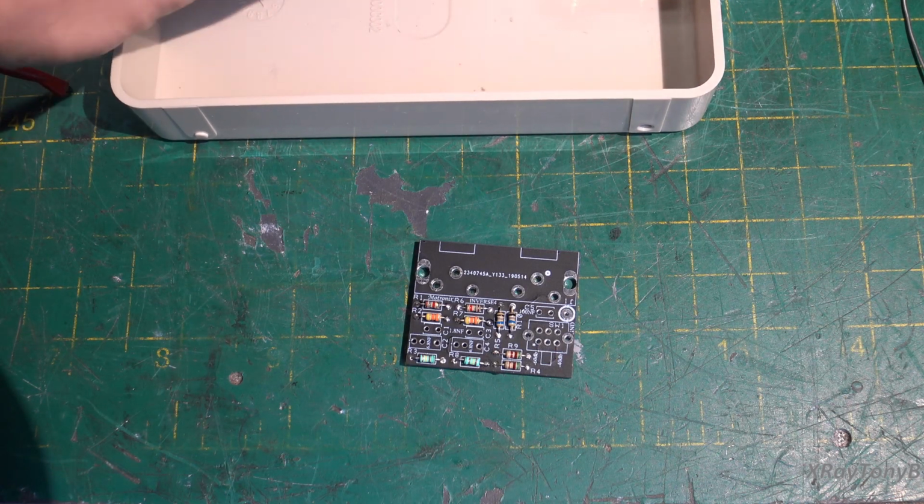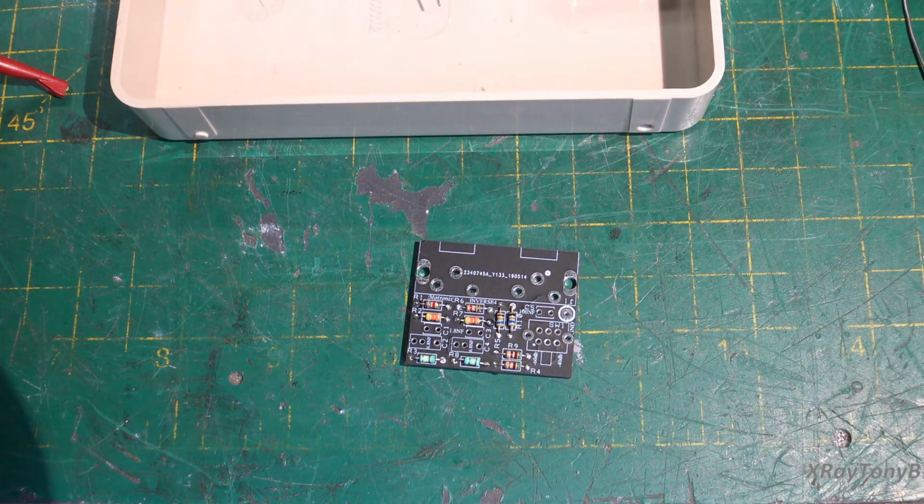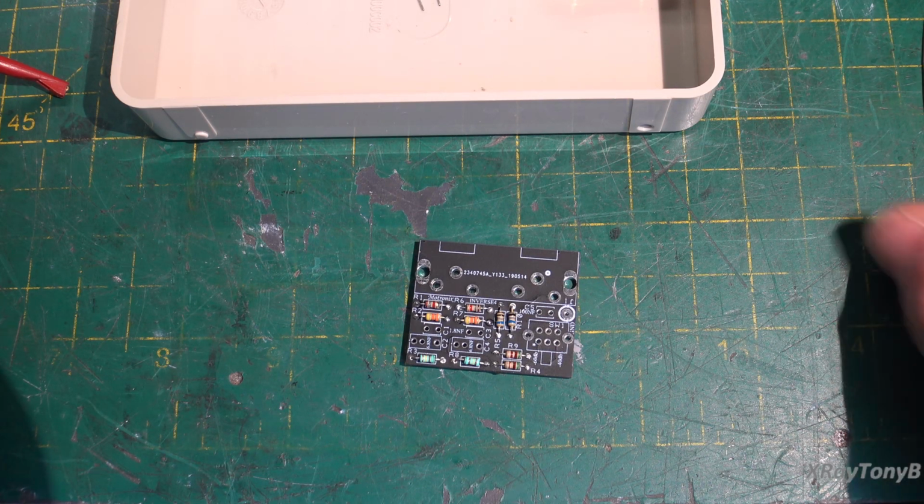Now a lot of you have asked me about circuitry and so forth for RIAA. One of the things is there is no hard and fast circuit that you can use in a preamp that will give you the perfect RIAA equalization for de-emphasis, because it depends on the design of your preamp stage. The preamp can actually color the sound itself, and when you're adding that de-emphasis, you have to take into consideration the coloration your preamp puts in, and either add or subtract from that. So designing a phono stage is not as easy as just taking an op amp and applying a generic RIAA equalization filter to it, because there's a lot of factors that affect it.